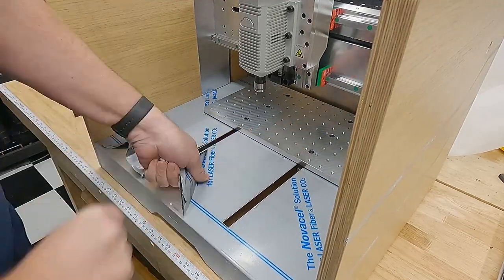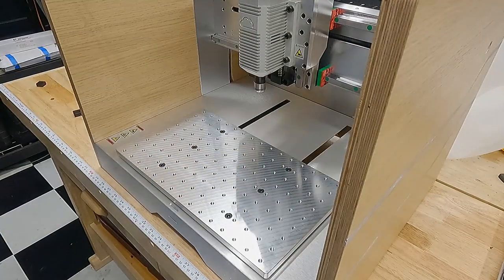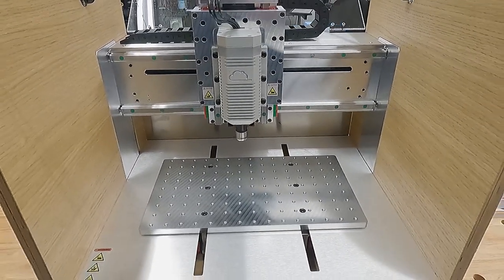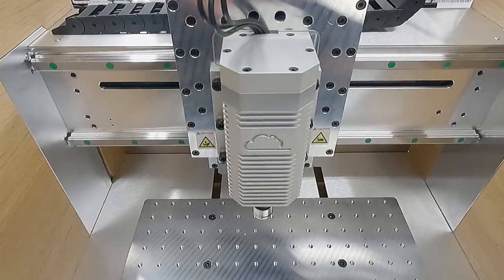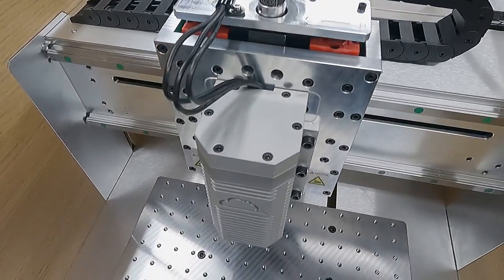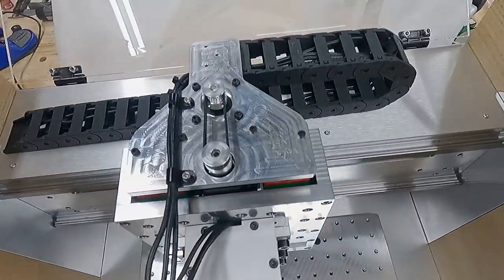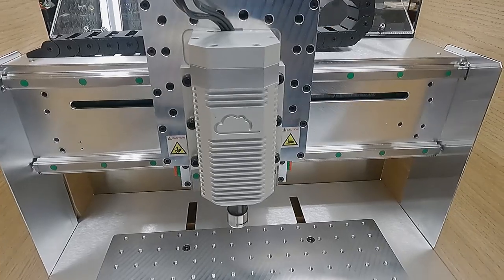As soon as you start milling it's all downhill, but that's okay. All of this aluminum flashing — that's 1/8 inch aluminum — is also protected. This machine is much more solid, with between 9mm and 12mm aluminum plate for the frame and platform. We've also got these larger linear rails, a larger top plate with a drag chain, and this brand new beautiful custom spindle. Now this is only a 500 watt spindle but it's not reduced like most other machines. On the top you see the Z axis NEMA 17 through a belt to the 1210 C5 ball screw which is behind the spindle.